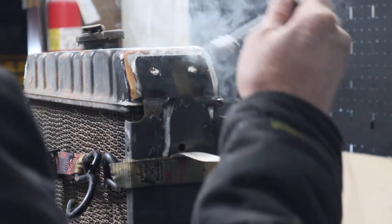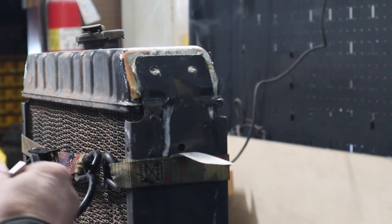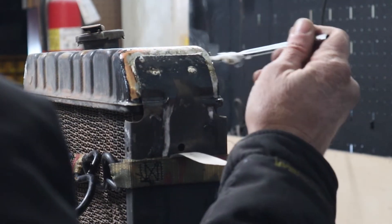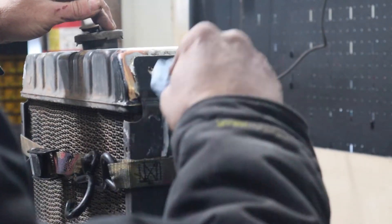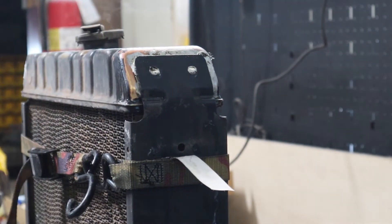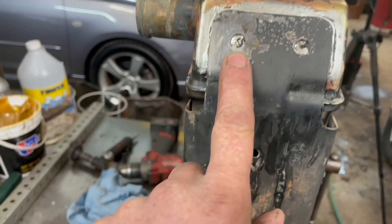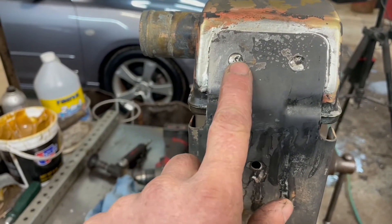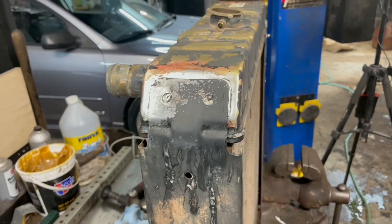Going to go back over with a little bit of flux. That's it for that side — we're going to hit this side next and see if we get the same results. And there's what you're left with — this is that solder I was referring to, letting it flow from the outside until it comes through these holes. If you're dealing with a bracket like this, that'll about do it. We're going to hit it with some heat paint and then get her back in the skid steer and get that thing back together.